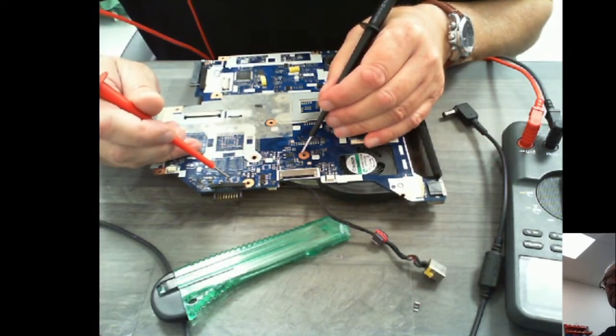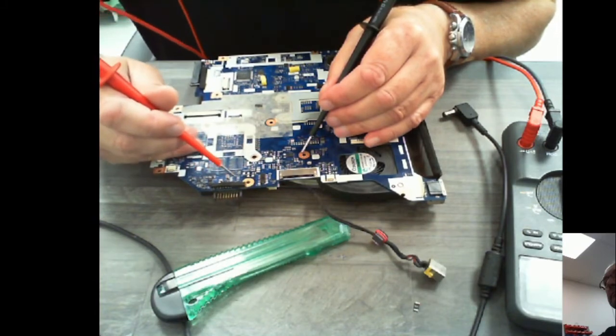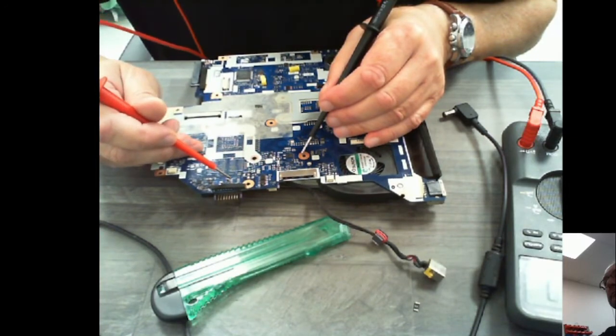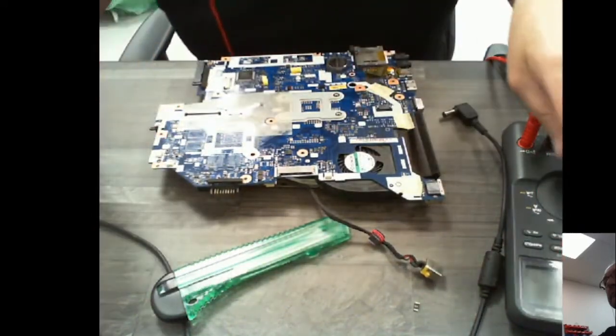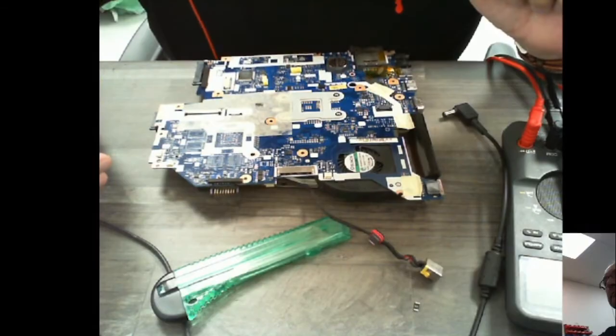I've removed also PQ11 here. This is part of the charging circuit here. So we've got earth that side. Nothing on that side. Right, I just need to get in close here and have a look at the circuits, what's left in this little area here, and see what's grounding to earth. Okay, so it looks like now I'm down to 3 possible faults, which are all capacitors, and it looks like they are just voltage smoothing capacitors, which is quite handy. I'll tell you why in a moment.